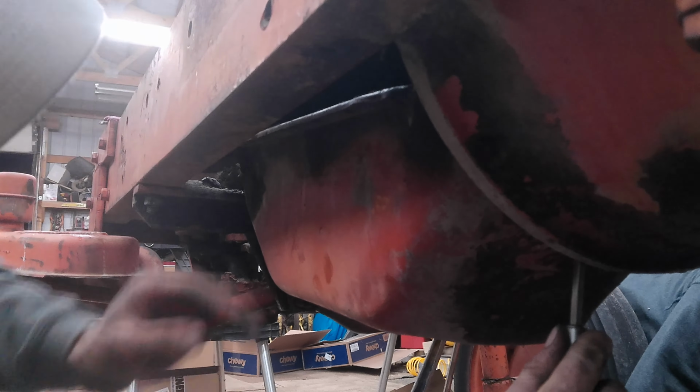Okay, looking under here, none of these bearings look like they have a ton of junk on them. At least the bearing caps from the outside. So here's our front. Looks like three main bearings. Here's the front, there's the middle, and the rear looks like it's our thrust bearing. The thrust bearing is the widest one, which is this one, and it prevents the crankshaft from bouncing back and forth too much, front to back, this direction. The purpose of the main bearings is to keep the crankshaft from going this direction. The thrust bearing also controls this direction, but this direction as well.